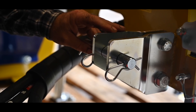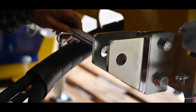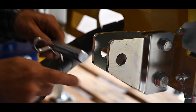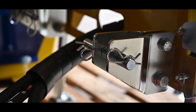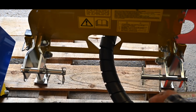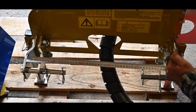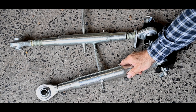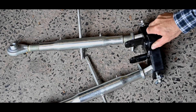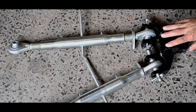The unit connects to your tractor's lifting arms through two connectors — one on each side. You unlock them and put your lifting arm in the middle. Keep in mind these are CAT-1 (19mm) bars — if your tractor has CAT-2 lifting arms you'll need to change that. Also check that your lifting arms can get close enough, as the spacing here is 55 centimeters from left to right. The Trimmy comes with additional stabilization bars that normally connect to your tractor's third point, but these may need adaptation depending on your tractor.